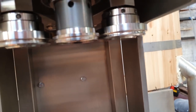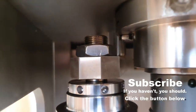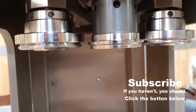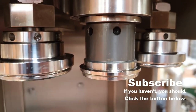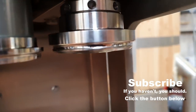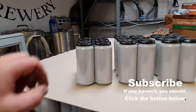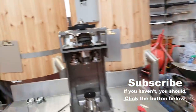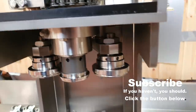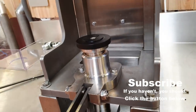The most important part of this whole component is getting these rollers set in the correct position. Would you look at the size of those bolts and those arms — this is made to last. The distance between the bottom of this roller and the top of this roller is absolutely critical — same on this side — for getting a perfect seam on the cans, basically to pinch the tops. If we don't get that right, we could get a leaky can.